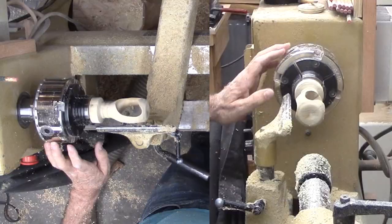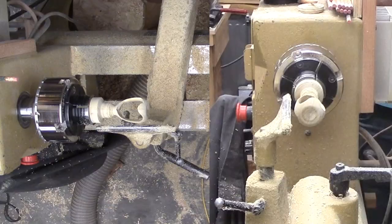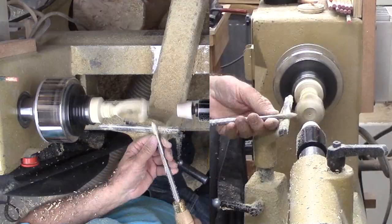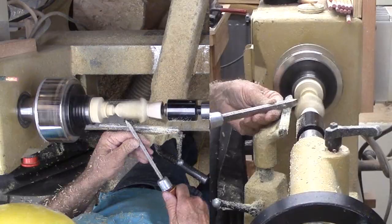As the shape develops, there is a piece 90 degrees off from the staves that is bothering me. This bump on both sides does not seem to be long. Time out before it gets too fragile — I need to drill a mounting hole in the top. Back for final shaping. My skew did not work very well. A bowl gouge for shear scraping does much better.